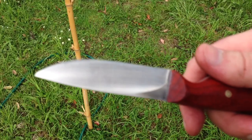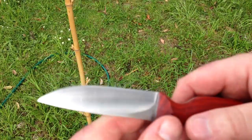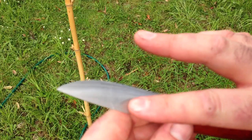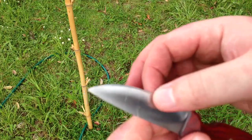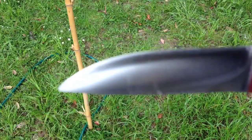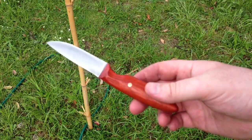You've got two options with a convex: you can do a zero grind to 15 odd degrees, but then you leave a lot of meat behind it. What I'm doing is making it very very thin and adding a micro bevel for strength normally. And that was basically kitchen knife thin — and that's what happens. So I'm going to go cure that.